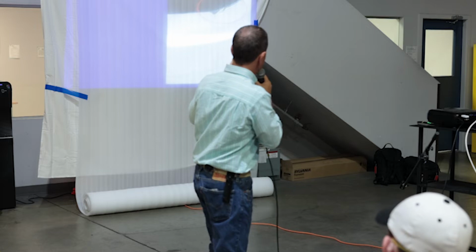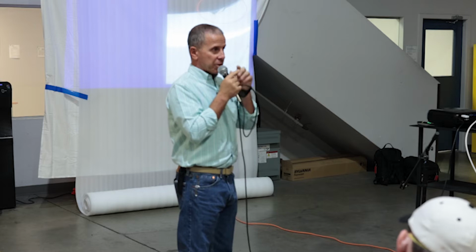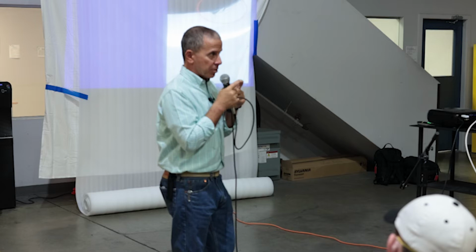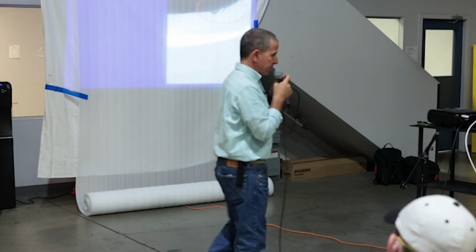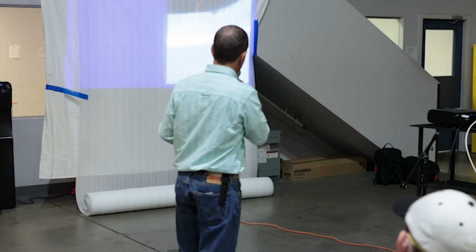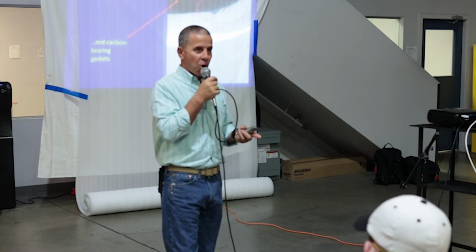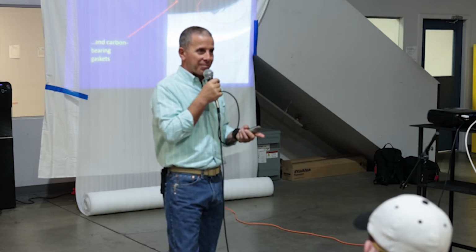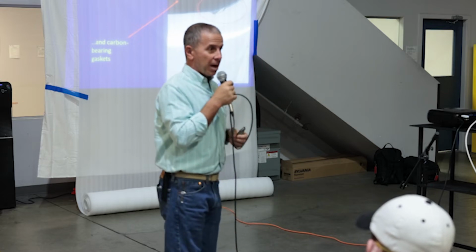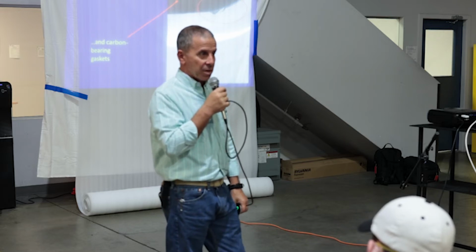So this window frame, for instance, it's hard to avoid that sharp edge. If those sharp edges can be profiled so they're more rounded rather than square, it allows paint to adhere to those surfaces more effectively. And in this case, we've got a complex corrosion scenario going on as well, because the gasket material actually has carbon in it, the rubber window gasket. And carbon, as I mentioned earlier, on that galvanic series is very harmful to something like aluminum. They're at opposite ends of that galvanic series.